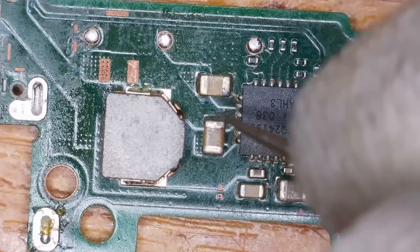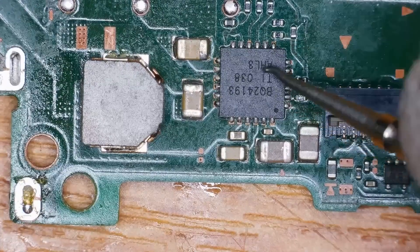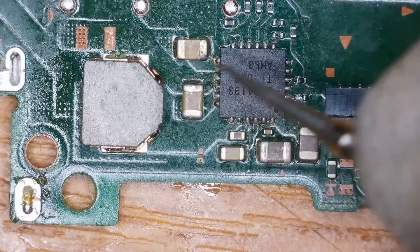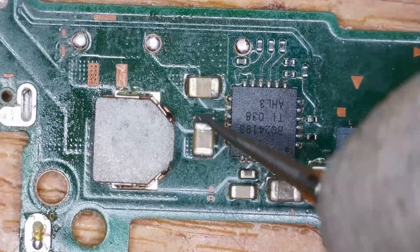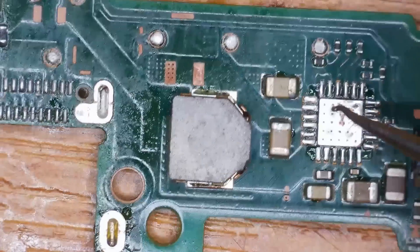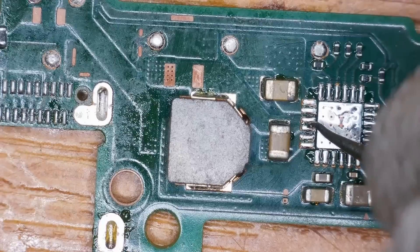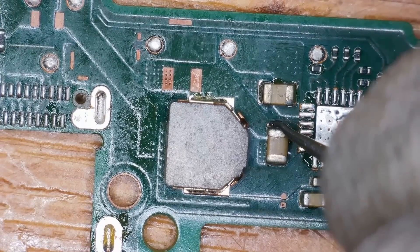Now checking if I still have a short on this cap — I do: 15 ohms. I'm going to remove BQ to see if that gets rid of this short. Even though injecting heat was showing elsewhere on the board, I don't know if BQ is the culprit. BQ's been removed — let's see if we still have the short. We do — still 15 ohms. So it wasn't BQ. I'm going to have to call it there and deem it a no-fix. I'd like to save it for a live stream where I have more time to just start pulling random components to find whatever alleviates that short. We have not fixed Switch number three.